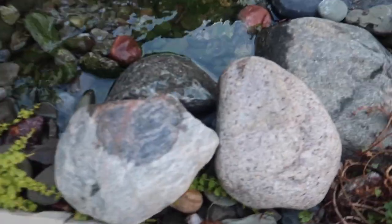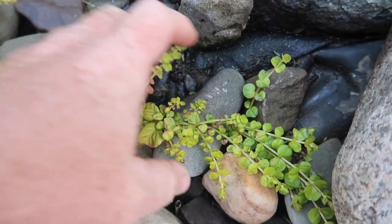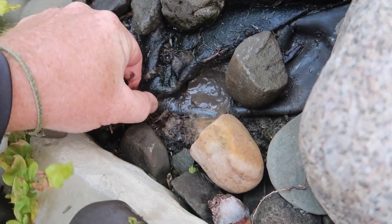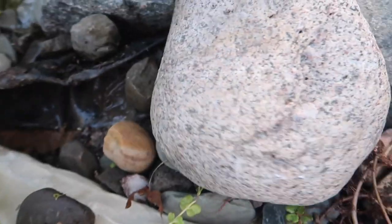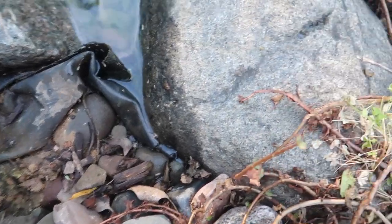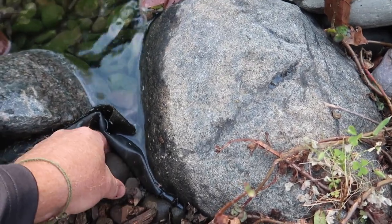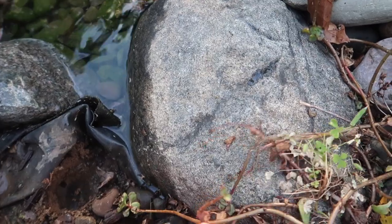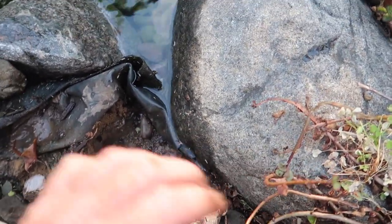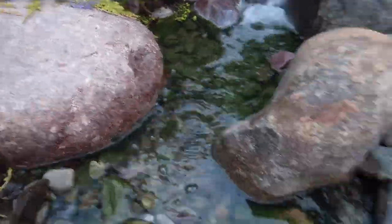So let's go back to how we fix this. I want to start looking at my edges and move some of these rocks around. Look at where the water level is in relation to the gravel — that is within a sixteenth of an inch. Look at how this has all been undermined over here; water's actually moving right through there. When you come and do fix-its, you should have a little bit of extra soil with you — some bag soil in your truck, a shovel — and at least a bucket of gravel. I'm going to lift this liner up a little bit more and more importantly try to open up those infiltration areas first, so you can see how much lower the water level gets once I unclog them.